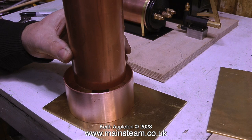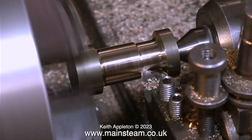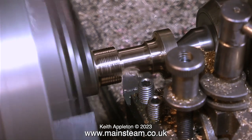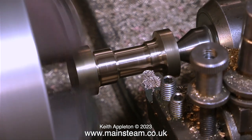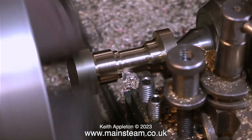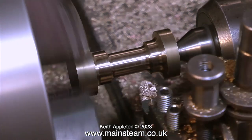In the time it took to machine the copper tubing, the bandsaw cut the piece of brass to the right size and it's currently being machined in my Boxford lathe to the correct length. When I hold the parts in position you should get the idea of what this is going to look like. In this clip I'm checking that the center column is the correct length by placing a ruler across the top of the tank and the column itself. Now it's time to machine the brass bar — I could have left it plain, but I don't like to see bar stock on a model in its original unfinished state. The machining makes it look more industrial revolution, and I'm being careful not to weaken it too much.